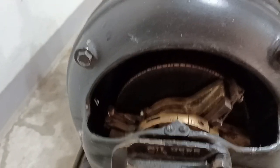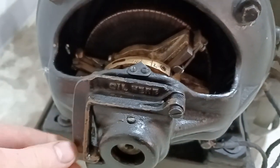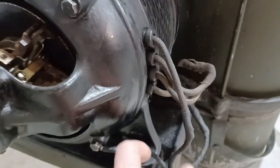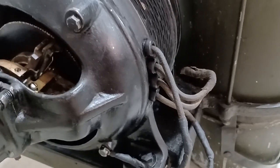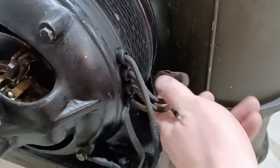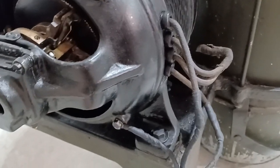These can be reversed by just loosening a screw and moving the brush riding mechanism only about a quarter of an inch, but of course that would make the pump run in reverse too, so we'll leave it the way it is. It's ring-oiled, sleeve-bearing, with nice caps on the oil ports. On any of these machines you'll notice four wires, and they can be arranged either in series for 240-volt operation or in parallel for 120. All of the ones I've acquired have been wired for 240, so these two middle leads are just connected together.